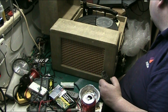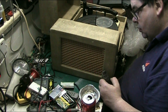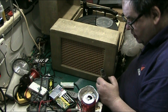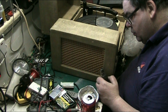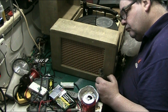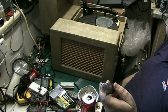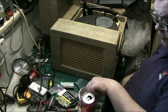I don't think I have got one. It's a 6X5 — it might have to be ordered because this is nice. I could put diodes across it; I might end up having to do that. But let's see if we can get a rectifier for it first. That's the problem — the rectifier is not lighting, the other two valves are, and it's stone cold, not lighting at all.